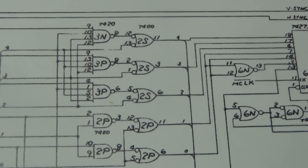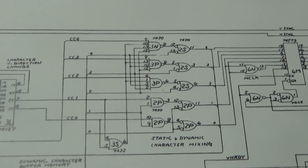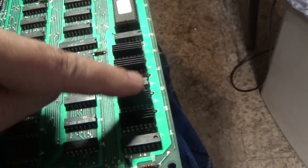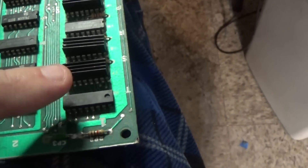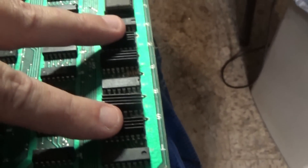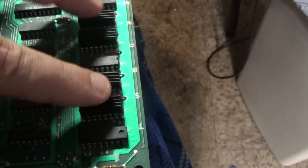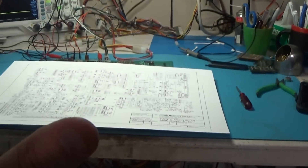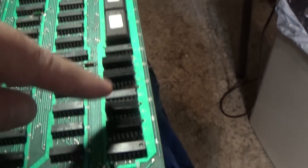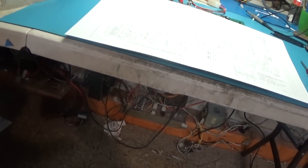I think our failure lies in here, so I'm going to start at the end of this mixing and work my way back. Let me show you a Galaxian board - here are those five RAMs. The way the Galaxian works is it's got this 174 right here. All of the output bits from these RAMs get buffered by this 174, and the 174 drives those RAM bits out to that circuitry. I've seen goofiness in the sprites from bootleg Galaxian-style boards based on this circuit not being present. So what I did on this particular board was I built that circuit.